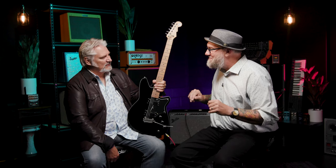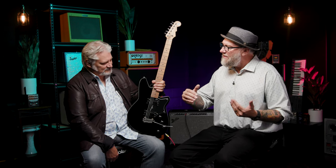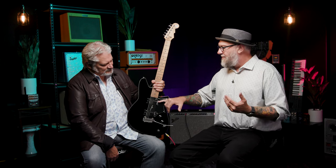You'll notice that a lot of jazz artists use blades underneath all those covers on those fancy jazz pickups, in order to hold that bottom end tight for neck position playing. And metal guys like having blade style pickups for the same reason. You get the compression and high gain, so you get excellent string to string clarity of the notes. But by compensating with the oversized pole pieces, it still allows a nice, sweet, jangly, warm top end.